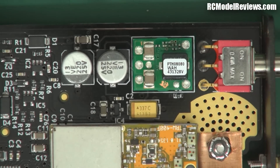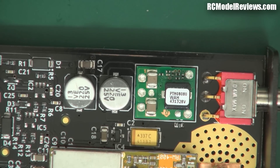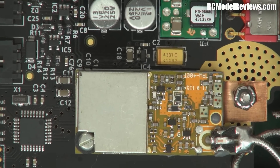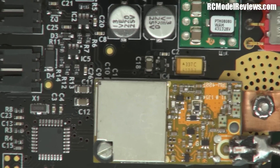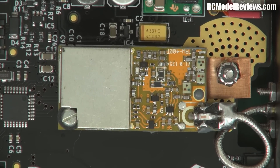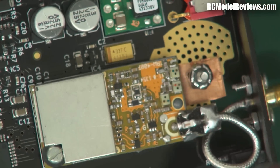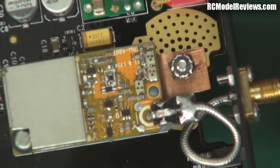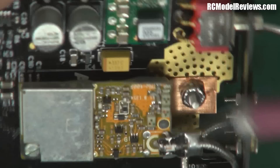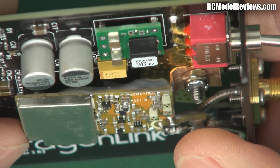This is the Lego version of UHF. The designers apparently decided not to bother with the hard stuff like designing matching and filtering circuits on the RF side, and not to bother with something as simple as a switch-mode power supply regulator — they just buy those off the shelf and build the rest. This strategy is increasingly used by manufacturers: they buy the blocks and glue them together. We've got some semi-rigid coax soldered on, going around everything, and a copper tab with heat-conducting epoxy onto the module. It's pretty bodged, really.